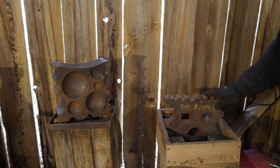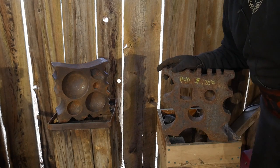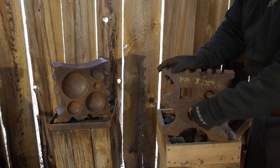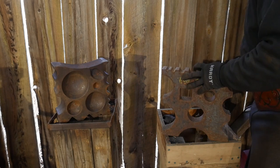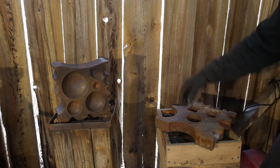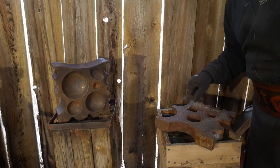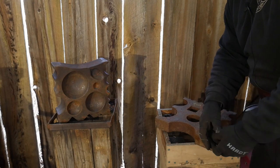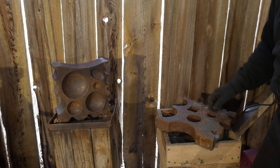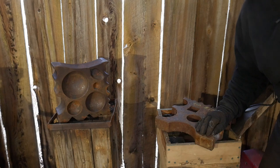This pass-through swedge block has holes through the face of it so you can do work like drifting hammer eyes out over a hole. You can lay this block flat, put something here, and run a big hefty drift through the piece. It has larger holes than your anvil's hardy hole, which may only have a three-quarter inch to one inch diameter, and in some cases you need to drift a much larger hole — so this swedge block is very handy.